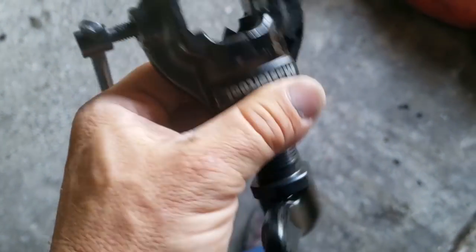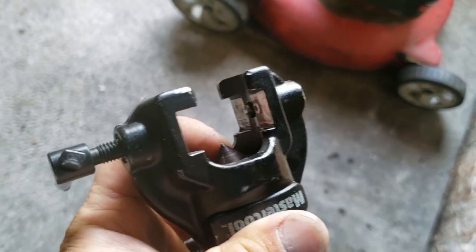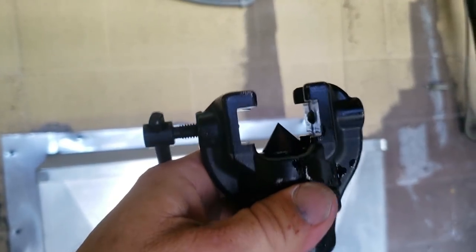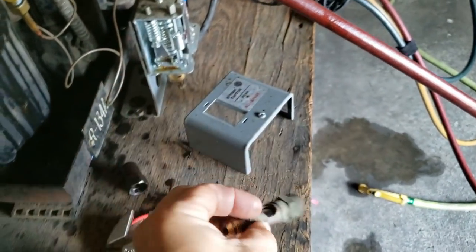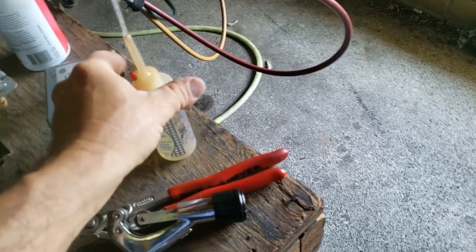So we're going to grab the flaring tool. We're using our orbital flare tool — same thing I use on Mitsubishi mini splits and whatever. It's got the head that sits there and spins and orbits as it does its thing. So we got our first piece in there, went ahead and cleaned up our sight glass — it's all better looking now, I was able to clean that all out. Got her all oiled up; what I keep in here is just an old oiler switched to POE. I just use this for flare joints or stuff like that.